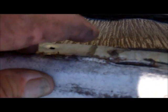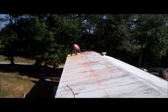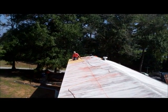Find the dead center. And then, so we're putting plywood down here, we're going to mark the outside edge right there with the black line so that when our plywood sits here, we can still find the bottom edges. Because what we're going to do is pop lines on that row again after we get them installed.